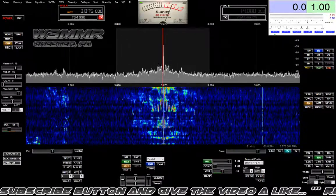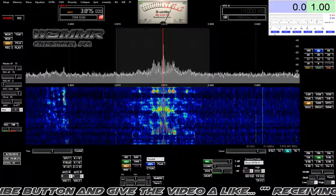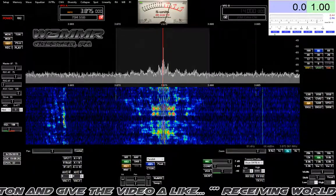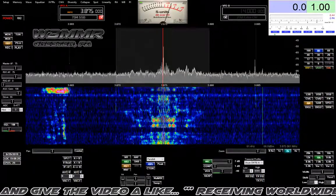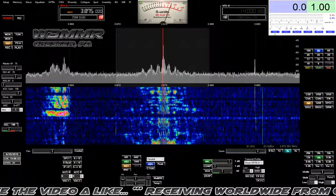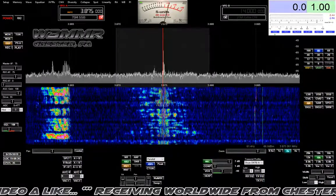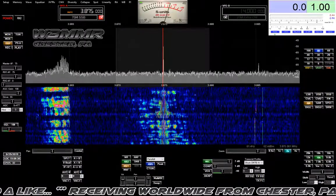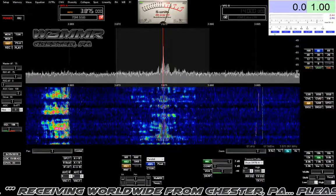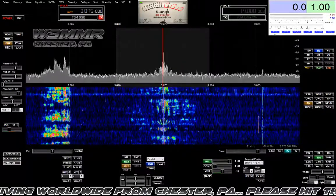I've had it in the shop for a while. I think I talked to you on it since I've had it up here. I'm around 100 watts. Same antenna, and I just put this antenna up yesterday. It's just an antenna for the shop area, for the radio shop, which is at the other end of the house from the ham shack. It's an 80-meter dipole, 60 feet, fed with 450-ohm ladder line, number 14 ladder line. You would normally be only about S9, even at this time of night, and you're 20 to 30 over.